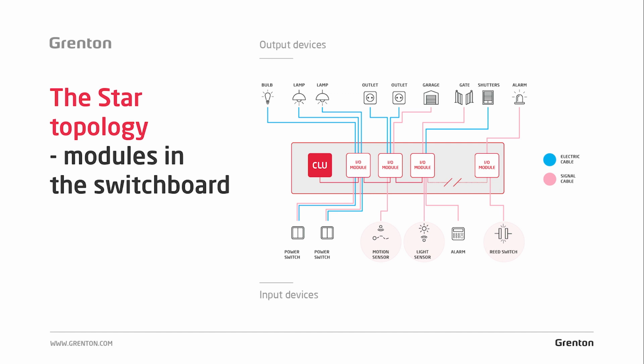It's definitely worth bringing spare UTP wires outside, and not just in one place but in 2 or 3, which can be used primarily to connect the outside temperature sensor, a rain sensor, if any, a wind sensor or a sun sensor. In the case of conducting the electrical installation, it's worthwhile to prepare some excess, more cables, and lead more of them, taking into account that someday some such sensors might appear, even if we don't install them at the early stage. In the future, we will always be able to come back to that.